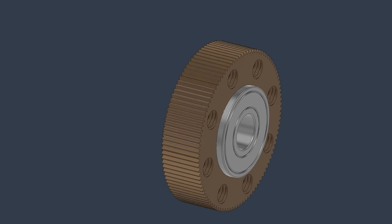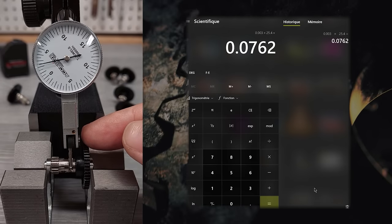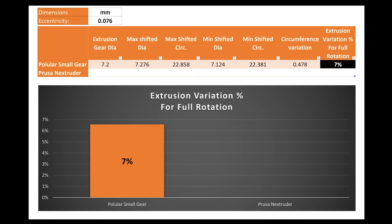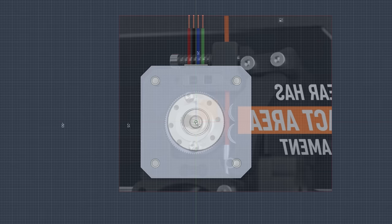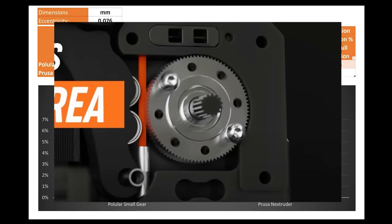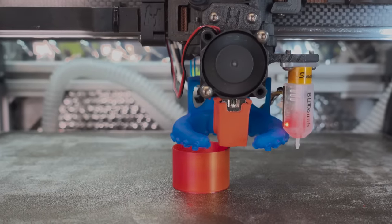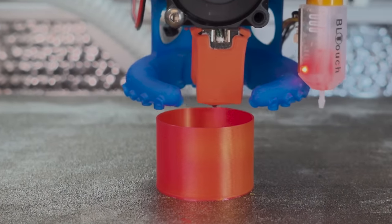The larger gear not only offers improved traction, but also minimizes the impact of machining tolerances on extrusion variation in case of eccentricity. For a smaller gear extruder like the ones we use today, a radial runout of 76 microns translates to a 478 micron variation — corresponding to a 7% variation over a complete rotation. Using a very rough estimate of 23 mm for the diameter of that new gear, the extruder will experience a similar increase in distance on its circumference. However, when comparing that increase over a full rotation of the larger gear, it results in a smaller increase of just 2%. In other words, for the same machining tolerances, the impact in terms of extrusion variation for the larger gear is going to be much lower.